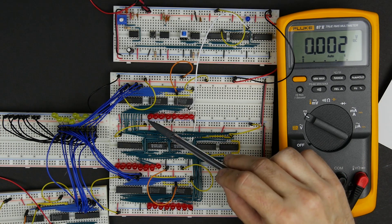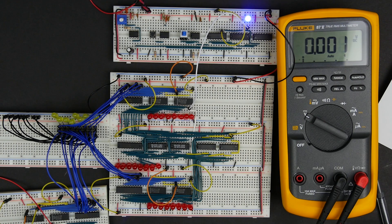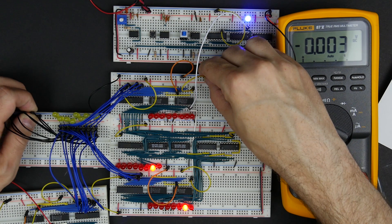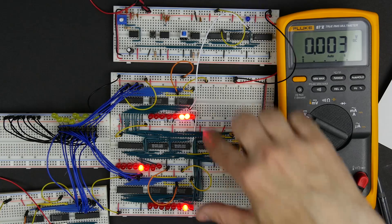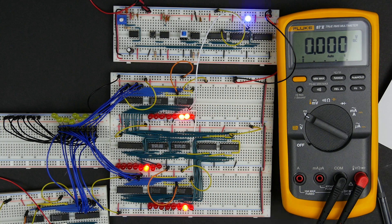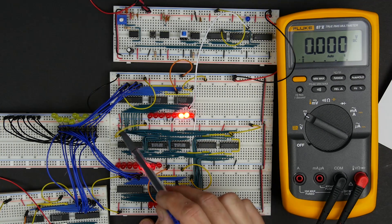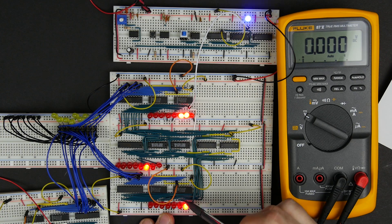Okay, so now I'm reasonably convinced we've got all of our bits in order. Now we can try some simple arithmetic. Let's load a six into the A register and a two into the B register. We've got a six in A and a two in B — six plus two equals eight, that's good. And if we turn on subtract, six minus two equals four. So that looks pretty good. I wasn't too sure what problems we'd encounter, but it looks like we've probably found most of them — one connection plugged in the wrong place, and two wires swapped.